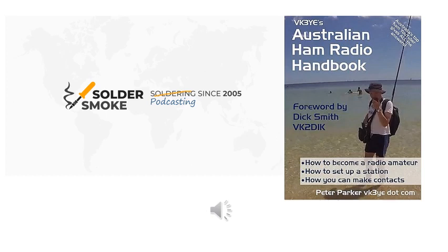An interesting parallel with receivers — if you look at receiver articles by Doug DeMaw, in almost all cases Doug will say you don't need S-meters, AGC, or DSP. They don't contribute greatly to basic receiver performance and just add complexity. But then he goes on to say you need frequency stability, a good front end, and a decent audio stage, and it's worth spending time on these. And Doug was absolutely right.